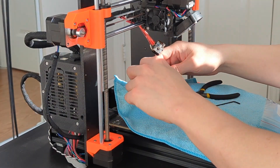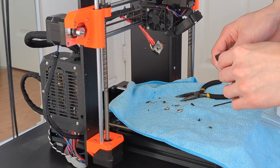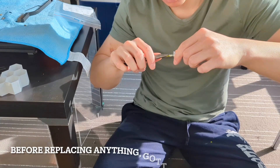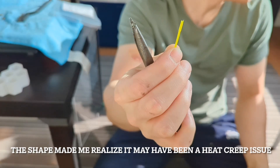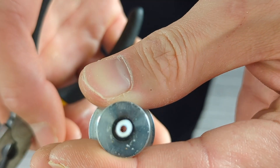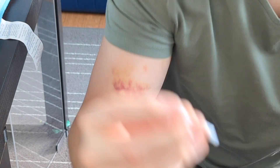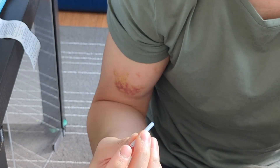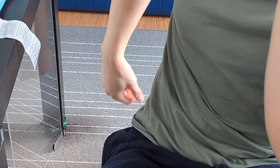This is probably an accumulation of all the PLA I've ever printed with, plus a lot of the PETG, and probably also the recycled PET, which is pretty sure the dirtiest thing on there. Now that that's gone you can actually see there's a hole here you can see all the way through. There's nothing wrong with it — completely fine, no burning of anything. It was just the filament. The filament just got stuck. I'm such an idiot. But hey, we're ready for it because now I know how to fix that part and get rid of a whole bunch of gunk on the bottom side of this thing.